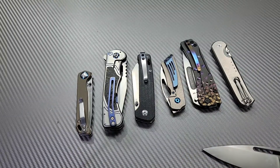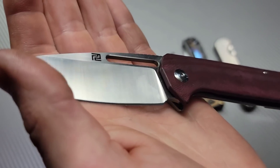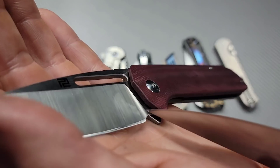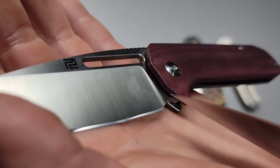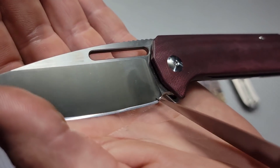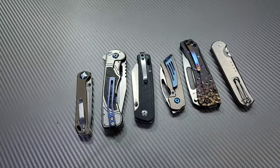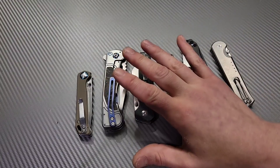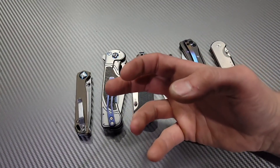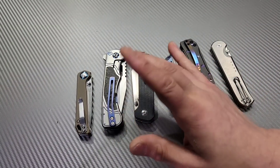When you have a tapering plunge grind — meaning it starts from the thickest point and slowly goes down to the edge — that's when we get issues. It's like from the thickest point it slowly drops down to the edge, but it happens to hit the edge rather than separating from the plunge grind. Just separate it. Make it so I have life to sharpen off my knife before it starts showing that I've been sharpening and sharpening. Because it makes it look ugly, and it hits the stone so it damages the stones.